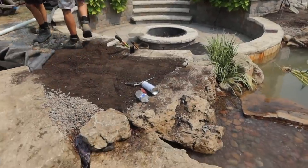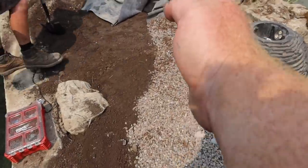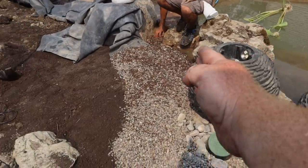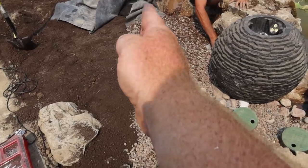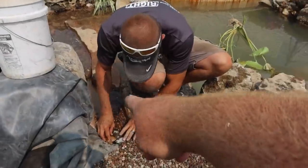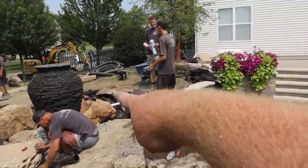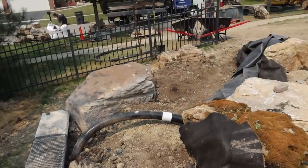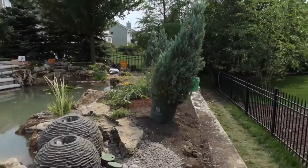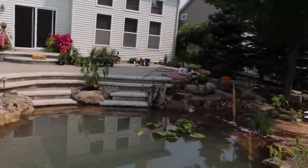You can see the rest of the guys finishing up the edges. Daniel just finished the back edges along these spheres — really important that he brought the gravel out considerably further than the edge of the pond, because splash from the small sphere will come all the way out there. The liner catches all that splash and lets it migrate back into the pond. He's finishing off this edge with some big cobbles, ramping up through there. We just need to add some soil and a few more rocks, then topsoil through all of this. It looks like we're going to be about a yard and a half short of topsoil, but we can fix that. Trees still need to go in.